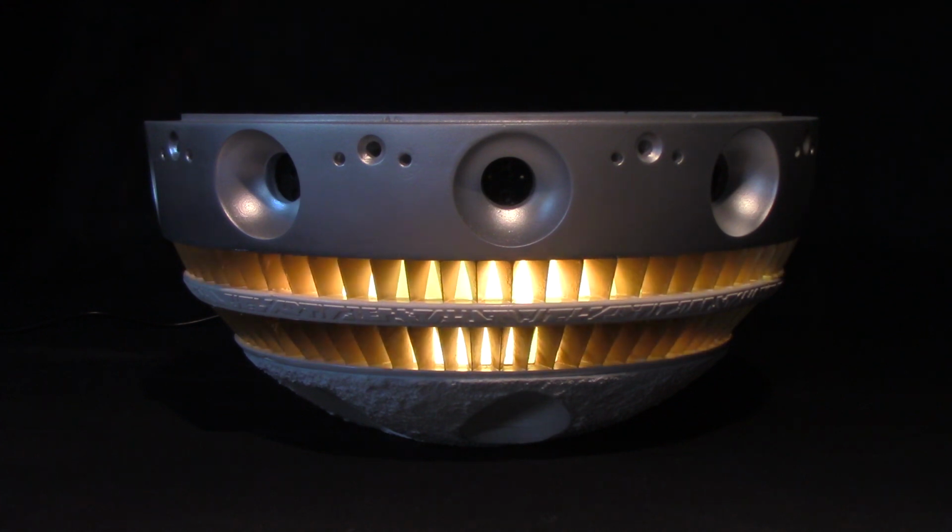And how I got the reverse rotation was a very simple way of making it so one goes counter and one goes clockwise. All I did was flip the strip the other way. I'm using 2 sections of NeoPixel strip. These are RGB LEDs that are individually addressable.